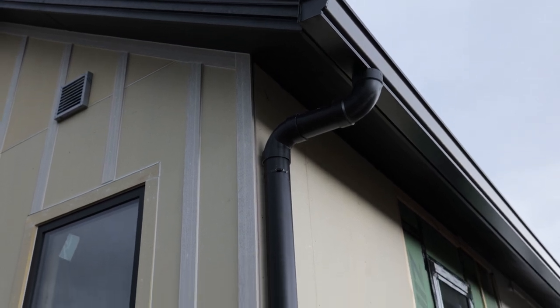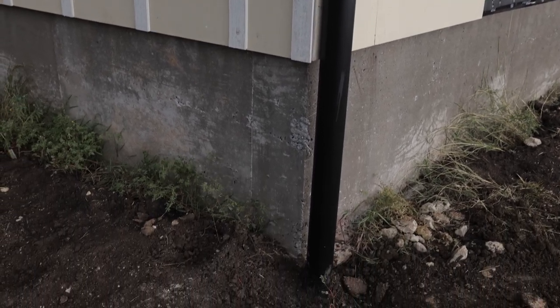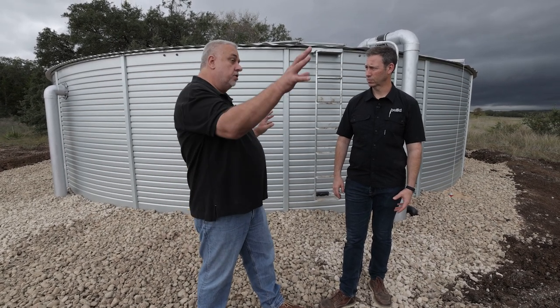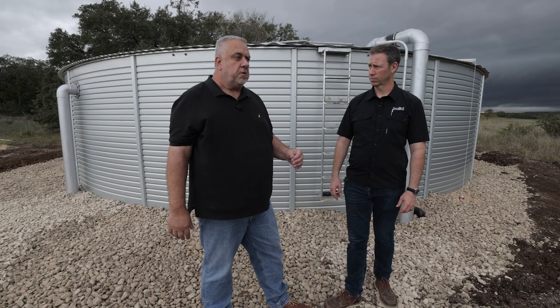So we have a bunch of PVC gutter work there. We kind of gave that industrial agricultural look. All of those gutters are interconnected. They come out here into a pipe, they fill the tank, and then as the water is called for, there's a sensor in the basement. We have a small basement section that turns on the pump, but it's a variable speed pump. So depending on the demand, the pump here either races up or accelerates or decelerates. Gotcha. That's probably the best way to explain it.